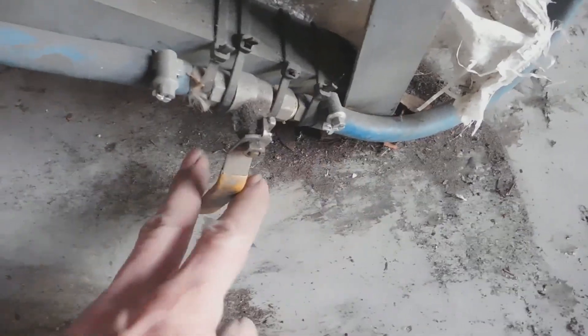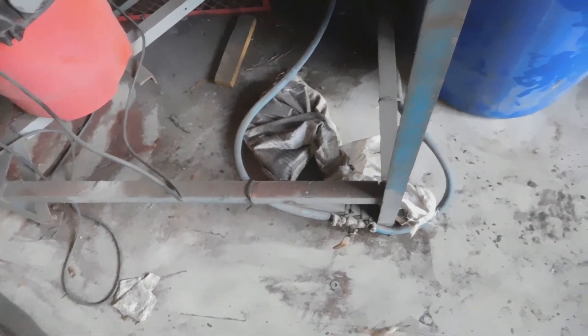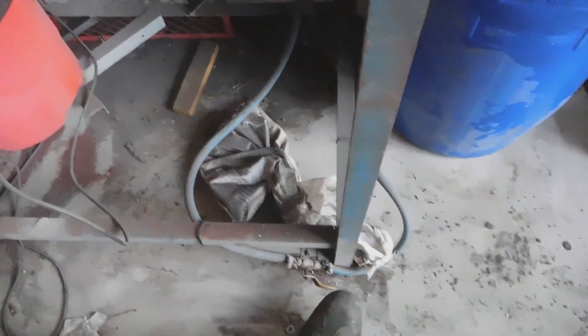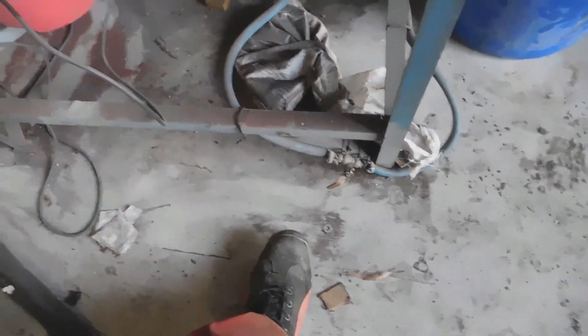The trigger's got a little pin inside, and there's another arrangement in there that actually cuts off the flow of air. I just took that out of inside there, so this just pushes in and it doesn't leak air out the front. That's how we get rid of the confounded trigger. Because without the trigger you can actually hold it by the hose like that and do stuff — it's just better not to have a trigger up there. Aside from the fact that the thing jammed all the time. Ball valve with the foot — it's easy enough. That takes care of controlling the air, so you can keep shutting it off when you're not actually blasting something. That way you keep the air up in the compressor.